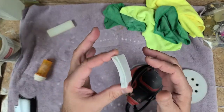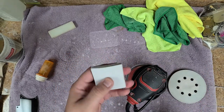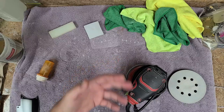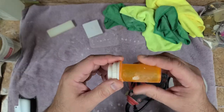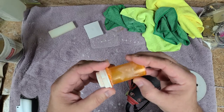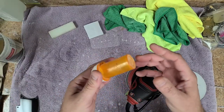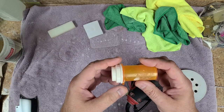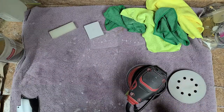It works out nicely — just follows everything evenly for a nice even sanding before polishing. This is for curved surfaces. For doing the horns on a Les Paul, Strat, or Telecaster style, I'll use this block as well. If I'm stripping, I'll put peel-and-stick adhesive paper on it. It works great for getting into tighter curves between the horns and keeping the surface flat while edges remain curved. I'll use this for either wet or dry sanding depending on the situation.